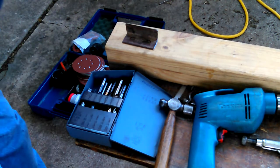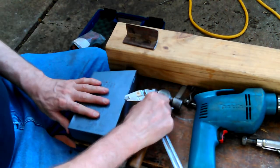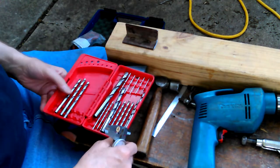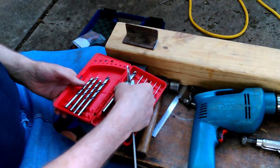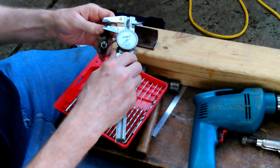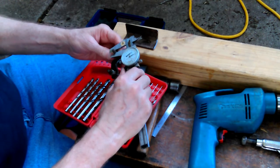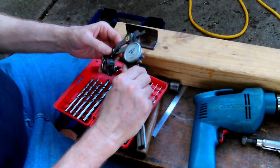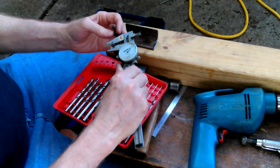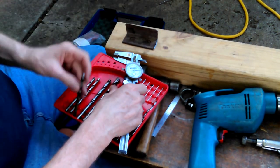When it comes to sizing drill bits, that's kind of a mixture of drills. This is a whole set, but I think they're not really all that hard. These are quarter 20, I know that, but I want to drill a big enough hole. It's close to 250. Yeah, it's really about 240. So if I get 250, I want them probably a little bigger than that, which is a quarter inch drill.